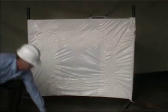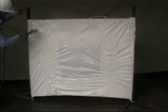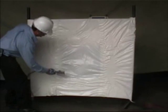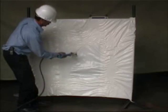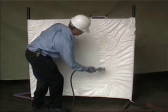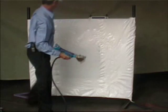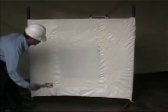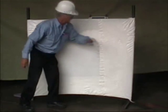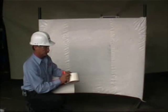Once all the seams have been welded in place, the area is ready to be shrunk. Holding the gun approximately 300mm from the surface, a light waving action similar to spray painting is used. You will achieve a working edge that you can then work across the plastic. If one area is not correctly cooked, let the surface cool down and then come back later. Once the area has cooled completely, the surface should be drum tight.